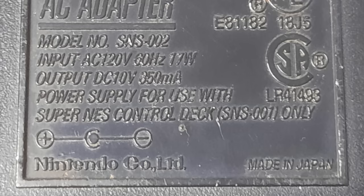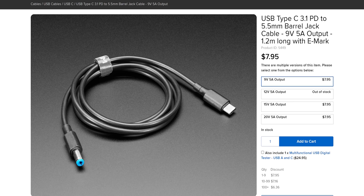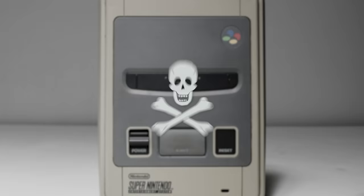Since I lost my spot in the game, we might as well swap out this 45 watt charger so we can power all three of these consoles at once. Super cool — and it's actually smaller than that crappy adapter that was only able to do one of these consoles. But wait, there's more. While this Super Famicom and Genesis do share a barrel jack size with the NES, and their power bricks will work with the NES and with each other, that comes with a slight caveat: Super Famicom and Genesis barrel jacks are negative polarity, meaning the positive and negative are swapped from a typical barrel jack. For this reason, they will not work with these cables unless a polarity converter is used. While discovering this did not damage our systems, yours might not be so lucky. You have been warned.